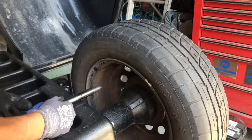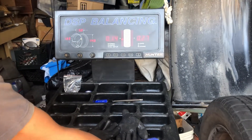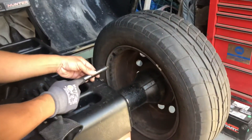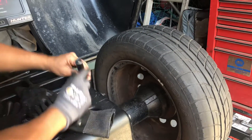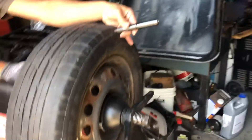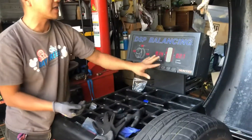After that, hit enter so the machine knows you did it. Then spin it again. The third step is to take wherever the tool ends and put it exactly on the opposite side. There are two threads, but put it on exactly the opposite side, spin it again, and finally the machine says calibration complete.